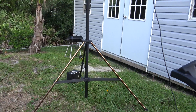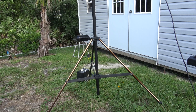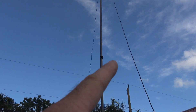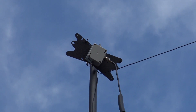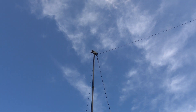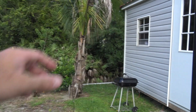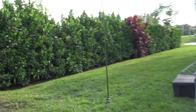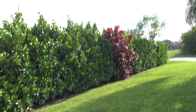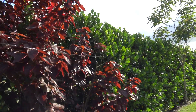This is how I have it — as unprofessional as possible — on my tripod here. I have to make some sandbags; I tied a battery to it right now because the thing flipped over and almost went through my window. So I have it up this high, feed lines right here going into the house. There is the feed point. I have one wire going out to the bushes out front, and the counterpoise — so it's 73 feet going this way and then 25 feet of counterpoise right here just laying on the ground. I even busted the wire, but there's the wire — not too high off the ground, in that red tree and tied to the hedges here.